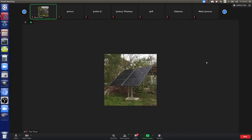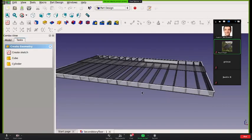So let's discuss this. Given the workflow, we have a pile of these rafters on a second story floor. We bring them up there probably through the stairway, because you're not going to put them above the second story walls. You're going to carry them up, or there might be a ladder. We probably may not have the stairs yet, because that requires interior sheathing on the house, which we won't have. So we'll probably have a temporary ladder going up there. We're putting the joists up there on the second floor, so we're going to take them to each side. One team works on one side, another works on the other.